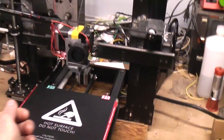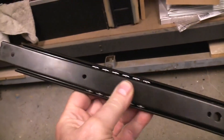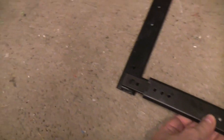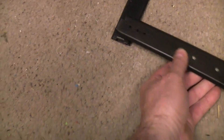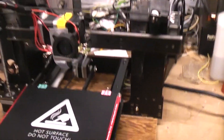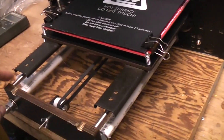I replaced the rods, bearings, and all of that with linear rails. I basically found these in a dumpster — they're metal ball bearing rails originally used to move equipment in racks, like in a recording studio. I took three of them, welded the ends square, then bolted the backs of those slides to the wood. For this one I just cable-tied the rail to the rods.